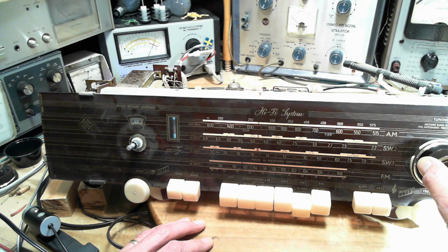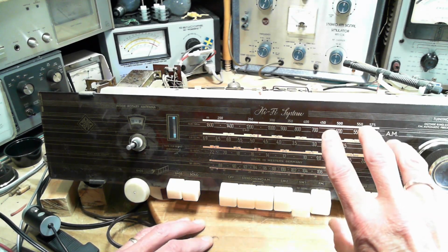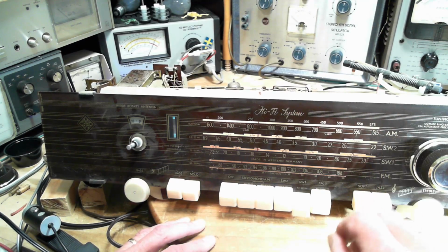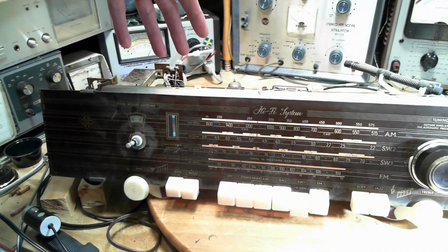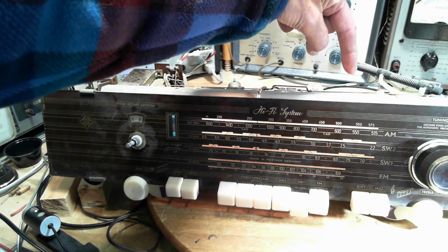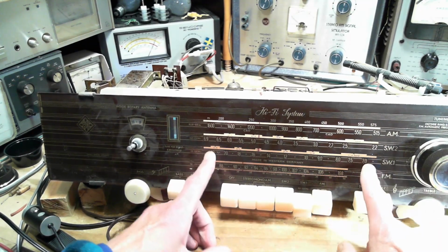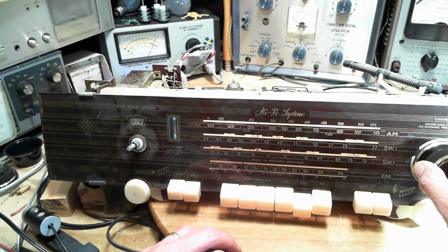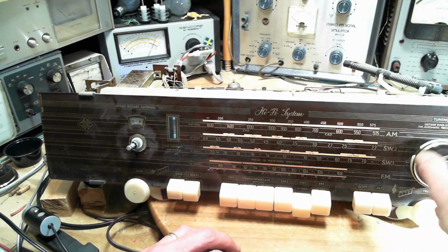Very hard to tune. A backlash in the knob, where you turn the knob and when you let go, the knob goes back. But we're talking about minuscule amounts of movement. And that's because of things like tension in the string system, most importantly, bad lubrication of the capacitor, and all these back forces when you're turning it. On a radio like this, see a big band here, 7 to 22. So is it tiny little movements in here that are critical? The whole thing becomes, I mean, you can go like this. Oh, there's nothing there. There's nothing there. See? Oh, something here.